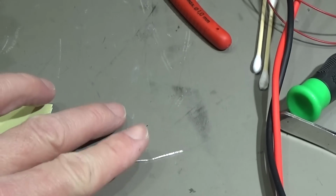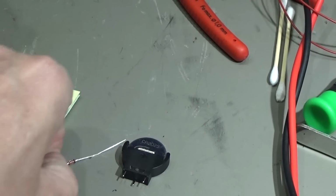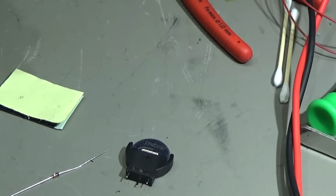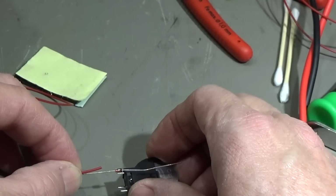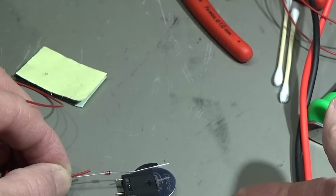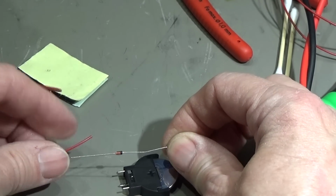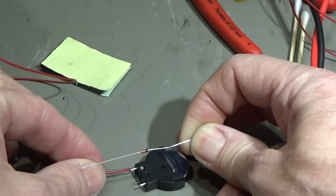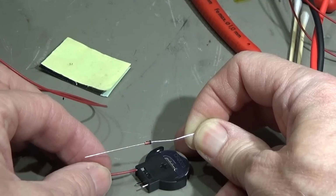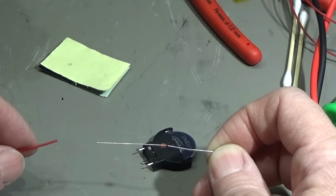So therefore, of course, we take this little Schottky diode and put it directly to the battery holder. When that is connected here over the wire to the holder, if somebody would like to change the battery to a rechargeable, then you can easily cut the wire off and connect it directly to the other pin, because we have here 2 positive pins, and that makes it very easy to change what you want to do. But now first we take it with a little diode, as discussed.